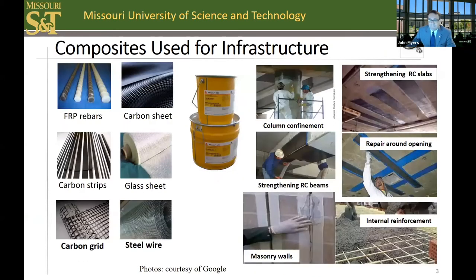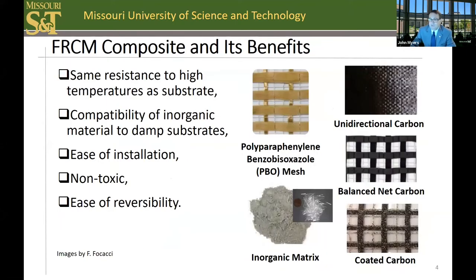In the 1990s, FRP, or fiber reinforced polymer products, became more widely evaluated and developed in Europe, the U.S., Canada, Japan, and elsewhere. These included the use of impregnated sheets like carbon with an epoxy resin. While this remains a promising repair strategy, the epoxy resin has limitations in terms of higher temperature application due to its glass transition temperature. Therefore, the development of FRCM systems provides a series of advantages compared to more traditional epoxy-based FRP repair systems.